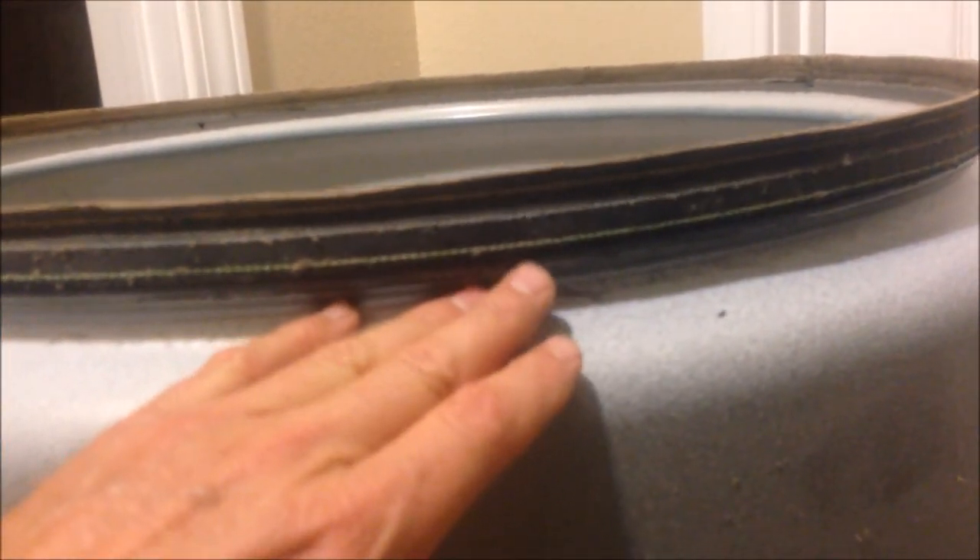We're going to look at this drum. I've already spent probably a half hour cleaning this ridge out. This is the ridge that the wheels run on, and quite a bit of rubber off the wheels had transferred to this ridge. I had to use my scraper and scrape it out, and then come back in with a degreaser and clean it up. I think it will be okay now.